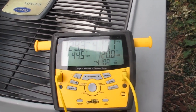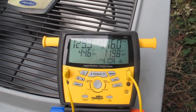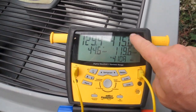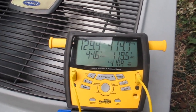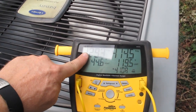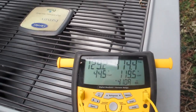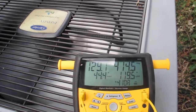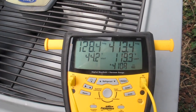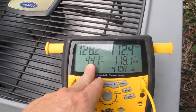So when I got there, he was charging it. He had the coil disassembled trying to check if it was clean — just doing all kinds of work. The problem he was having is that the suction pressure was about the same as what I've got here, which I was alright with. But the other side was 103 pounds, and 103 pounds put the saturation temperature right around 34 degrees.